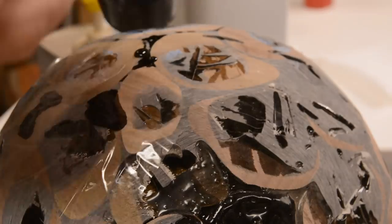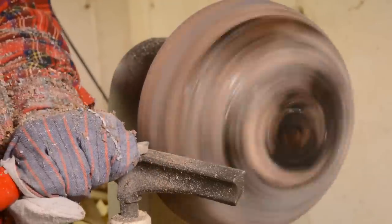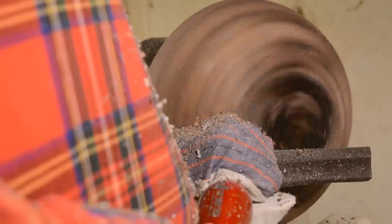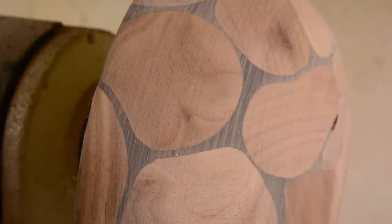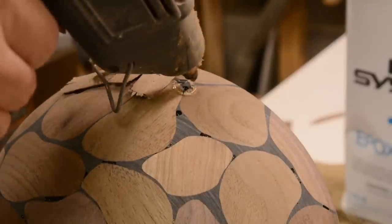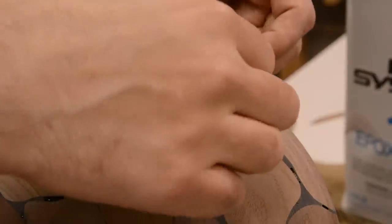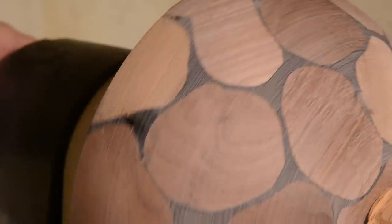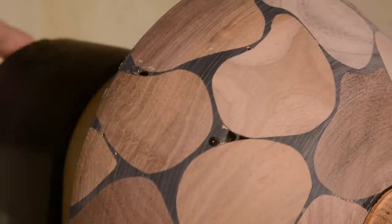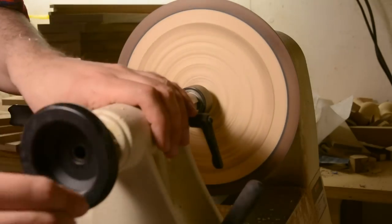After five epoxy pours, it's finally ready to go back on the lathe. I'm wearing gloves here — when you're going through the part where the epoxy is just sticking out and comes off in little chunks, that stuff hurts. Once you get past that into the actual bowl you're okay. I still had quite a few small voids and spent a lot of time trying to find a way to deal with that that works. Once the holes get down to about an eighth of an inch or three millimeters, it's very hard to get them filled. Even with gravity on your side the epoxy just does not want to go in there. It's very frustrating to have a hole that looks like it's covered and then you sand the epoxy off and the hole is still there.